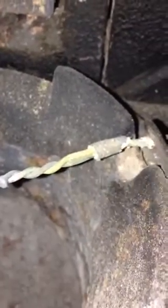And if you remember in science class, when you put two dissimilar metals together, it makes its own voltage. Current flows through them, and when you heat it up, more current or voltage goes through it. And that comes back to the control board to tell it what to do. We'll get more into that later.